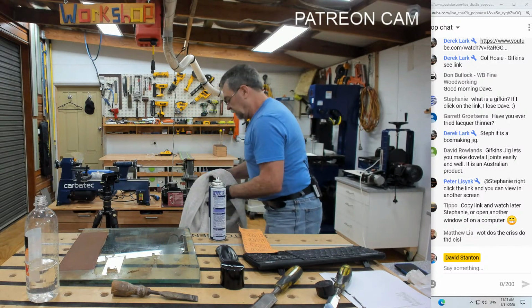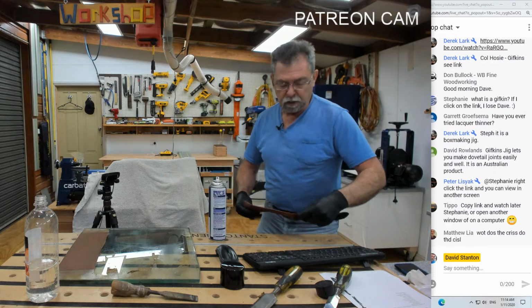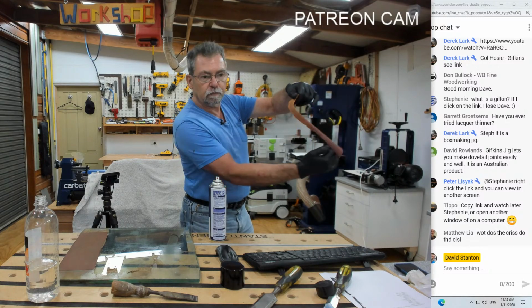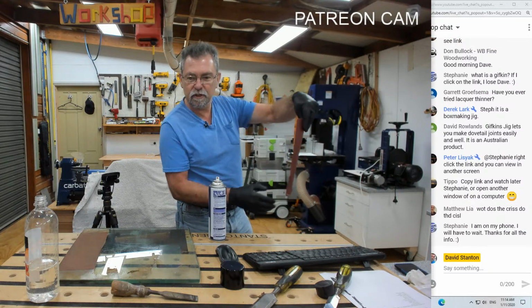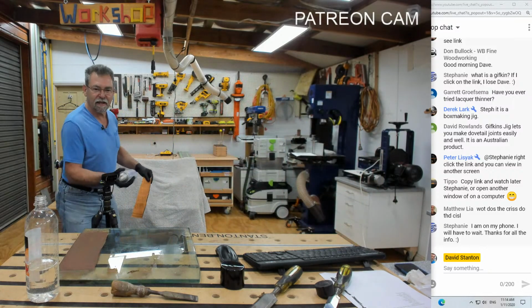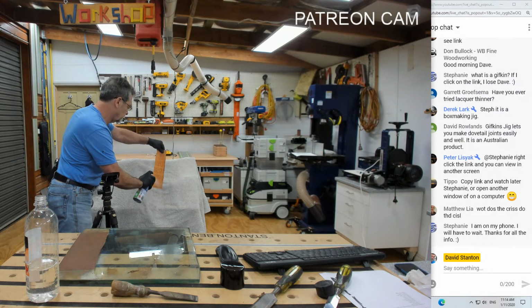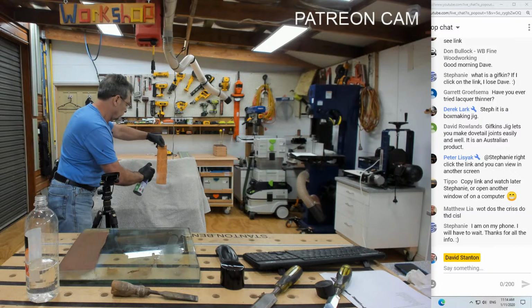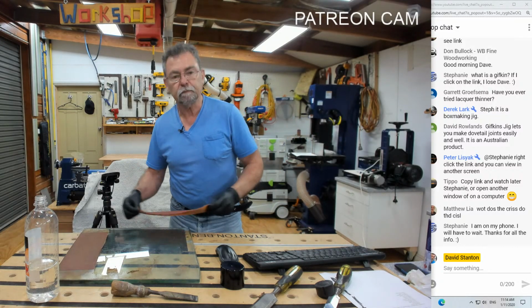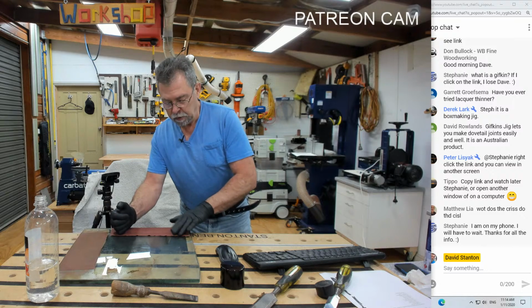I'll show you what I mean. I'm going to throw this over all of that. And that's my backing for the spray. I'm going to hold it so it's curling this way. Otherwise, when I spray it, if I was just holding it flat, the spray would make it blow away. So we want to do this to give it some rigidity. All right. I'll have my back to you slightly. Don't breathe in the fumes, but just a little quick spray. And then the other way up. And while it's like that, we put it on straight away. Also, I leave a little bit hanging over the edge. It's more important with the wet and dry than it is with this, but that's what I do.